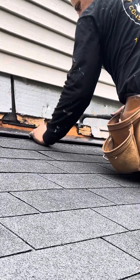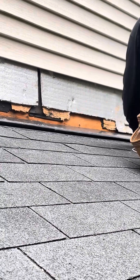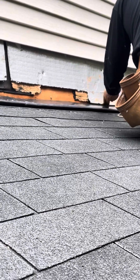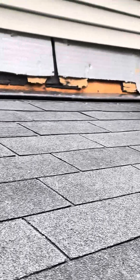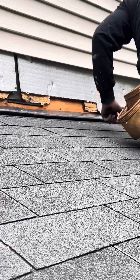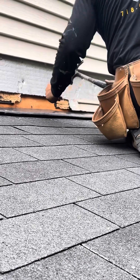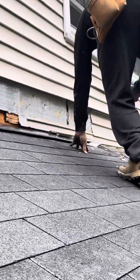This helps let the roof breathe. He's gonna nail it with roof nails — give it like three or four nails in one spot, because you don't want too many nails on the roof and you don't want any leaking. You have to make sure it's tight to the wall because this is roof-to-wall, and that's how this roof-to-wall vent is installed — easy peasy.